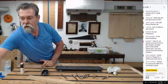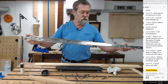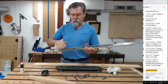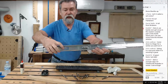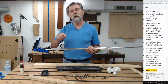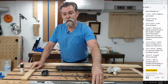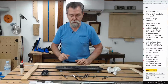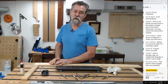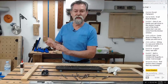Now, the thing is, when I'm putting the screws into one of these drawer slides, and this is a soft close drawer slide, and I love using the Euro screws in this because they don't go anywhere. The screws hold it strong. They don't move around at all. You've got the large hole here that it goes into, and we don't want it to go all the way through a 16mm piece of melamine. So the 16mm with the 5mm drill bit was punching through. Only just, but it was doing it. The 11/64 stops at the perfect depth for the Euro screws that I use. And I think I use an 11mm deep.